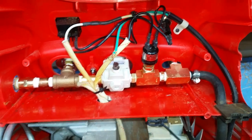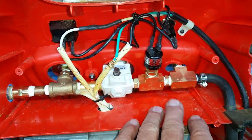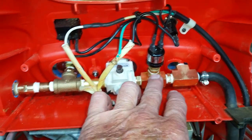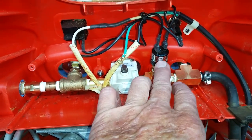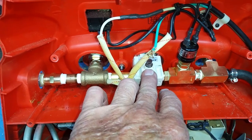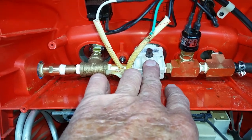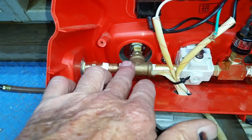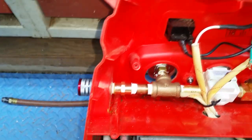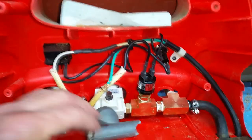What I've done is replaced the manifold using T-fittings. I got a T here for the shutoff, put in a brand new pressure regulator, plugged off the gauge port on the regulator, and moved the gauge over to a T so it sticks out the front — then more couplings and over to a quick disconnect.